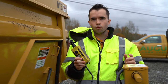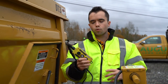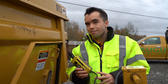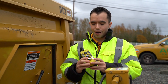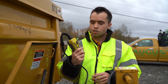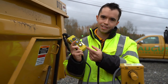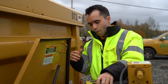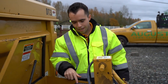I'll go through some of the things we paid a little extra for. The gravity feed was one of them — I think we paid a couple hundred dollars for it. This is going to be the difference between getting maybe three to five dumps versus five or six dumps by having less charge needed to bring the trailer down. When I push the gravity button, you'll see it's silent and it still goes down — it just takes the weight of the trailer to move it instead of the actual power of the motor.